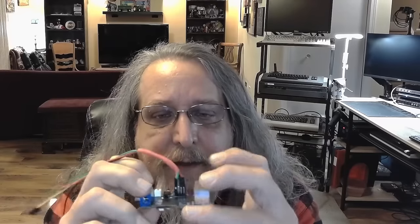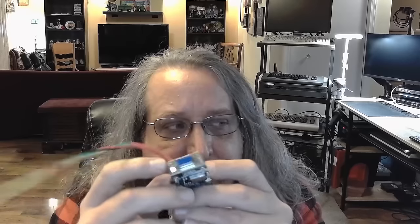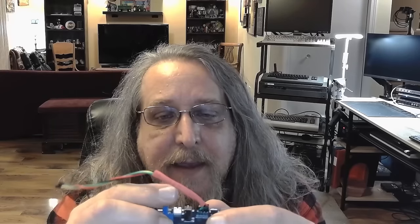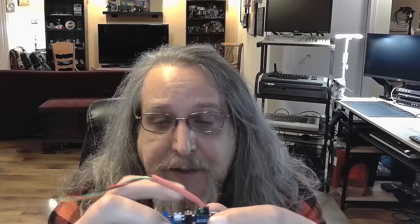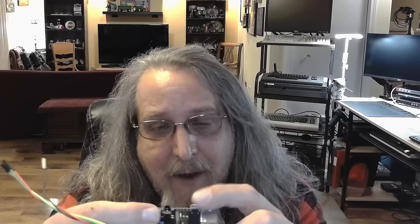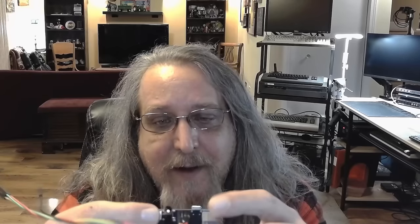What you can see here is an ESP32, and it's got a VGA output on that side, and PS2 inputs on that side for keyboard and mouse. It also has audio, by the way. You can hook up a battery to it, so it's battery powered, and I think you can run it off another 5 volts. In my case, I'm powering it off the USB, and that's also what you use to program it. You can put a micro SD card in here. I haven't used that yet.